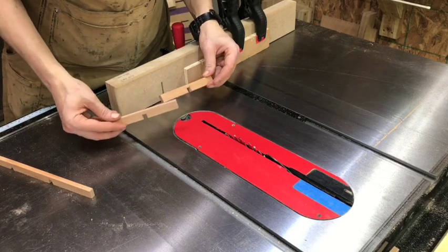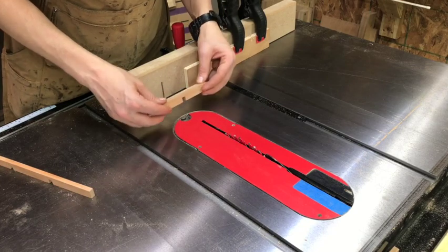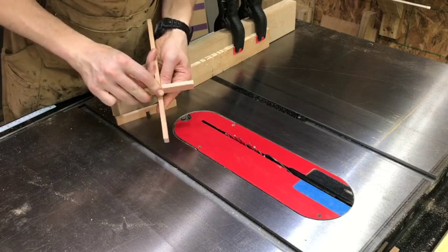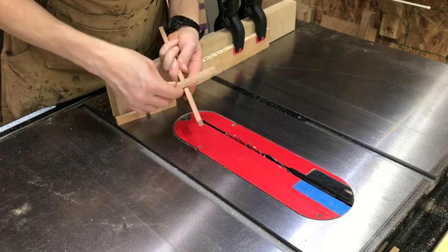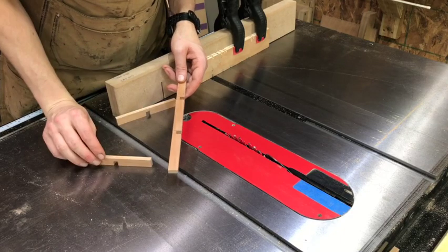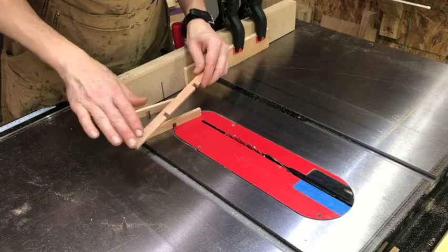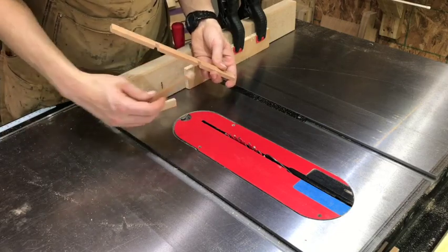If you try to cut these separately, it's quite possible they will not be perfect if your markings and your lining up with the saw are not perfect. Now, as you get to the end, if you get real close, which I've gotten here, and trying to get exactly that width away on this would be pretty hard, just go over and lightly sand this middle piece until it fits, and that will give you a perfect fit without worrying about overshooting it. I've got to remove a few pencil marks on here anyways, so I'm just going to lightly sand with 220 just by hand, a few swoops, and get it until they sit right in there.